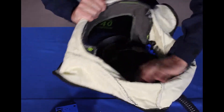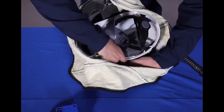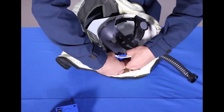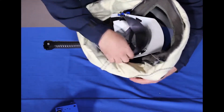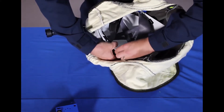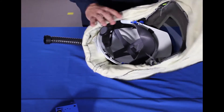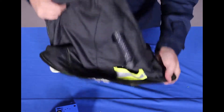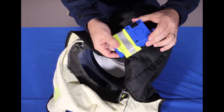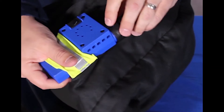Make some space inside the hood to install the hardhat. Make sure the adapters fit the hardhat — don't change the hardhat, because if the adapters don't fit they will break. If your adapters break during this process, you should have replacements available. Line up each of the parts, careful not to scratch the inside of the lens with the front brim. It clicks into place — now locked in and secure. Open up the suspension so it's easier to put on your head. At the back, install the ventilation system by sliding the fan unit into the strap, connecting the coupling with just a little turn to lock it. Don't over-tighten, otherwise you can break the plastic parts.